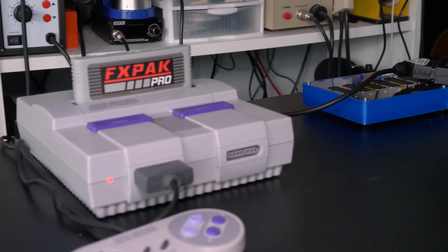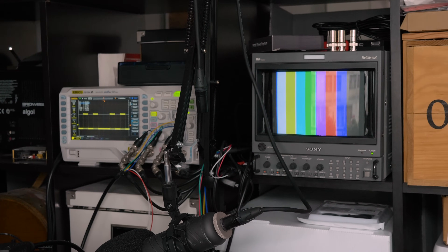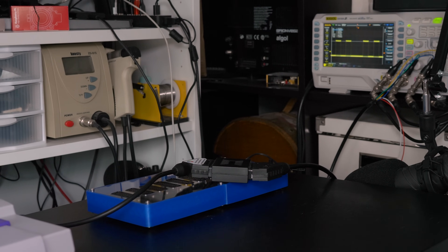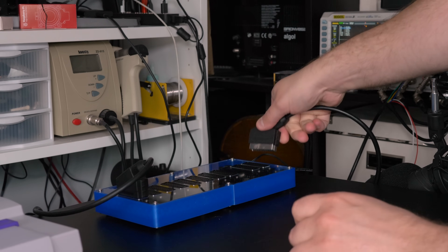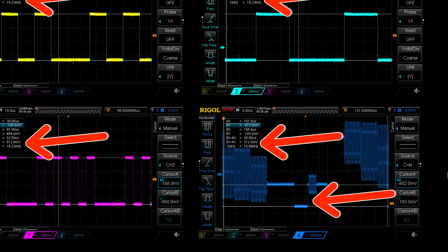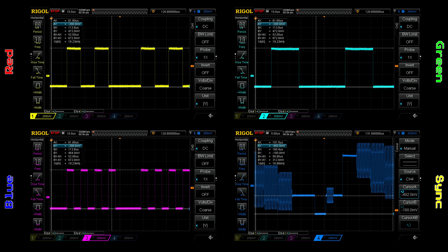Next, I wanted to see how the switch affects the signal of the console by using an oscilloscope to measure how they affect the voltage. I'll be using a Super Nintendo outputting 100% color bars so we can have a consistent reading, starting with measurements taken when connected directly to the scope as a base reading. You can see the full composite video signal, with the sync information being the square wave at the bottom. First, through the GSCART — the RGB levels appeared identical to the control test. When sync regeneration is turned off, the composite video signal matches as well.